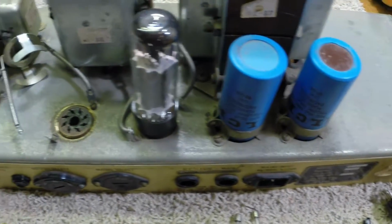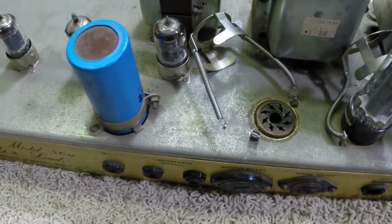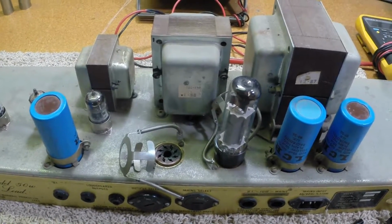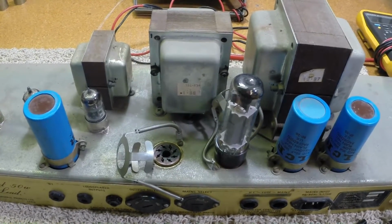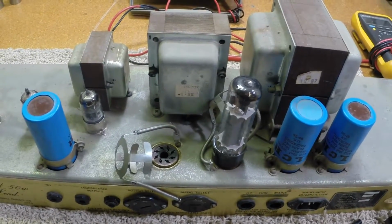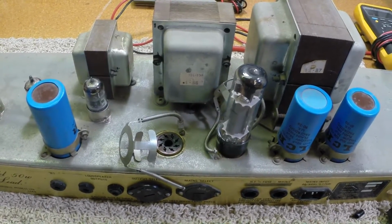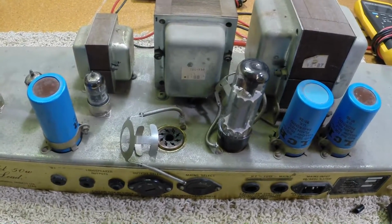Something else I noticed first thing right off the bat, it's got the original capacitors in it. These things have got to be 30 years old. It's an '88 model amplifier. A late, great amplifier guru, who was regarded as one of the best Marshall men on the planet, religiously believed in changing filter caps on these Marshalls about every 10 years. I subscribe to that same school of thought, and I've discussed it with the customer, and we're going to do that also. We're going to find out what else is wrong with the amplifier first. We're going to make sure we don't have any transformer issues or anything like that. This took a pretty good hit.